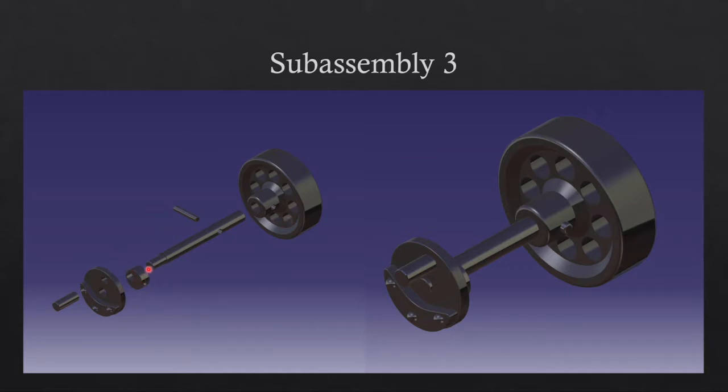The eccentric rotates with the rod and pinwheel but operates the valve, which produces the outflow of steam going into the upper chamber of the one-lunger. The crank pin — visible in the final assembly — is what the piston assembly uses to rotate the entire crankshaft, providing the mechanical power from the steam to the rotating pinwheel.